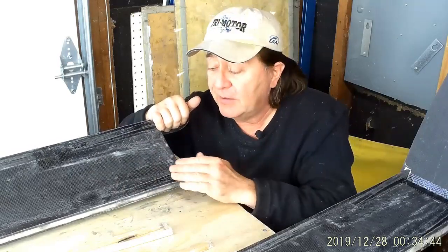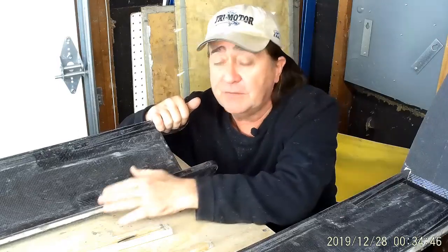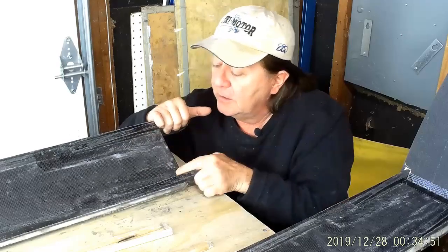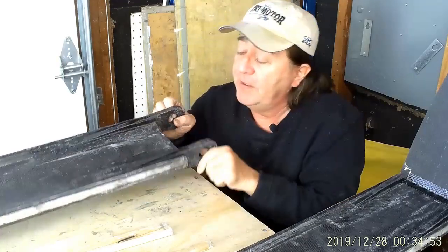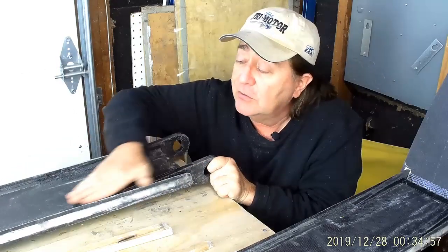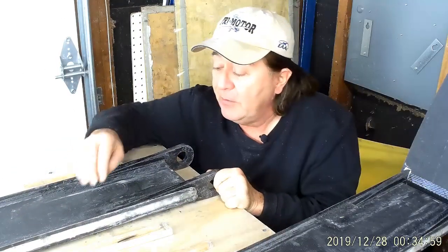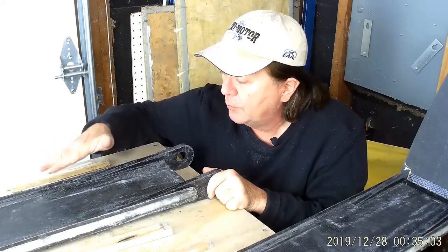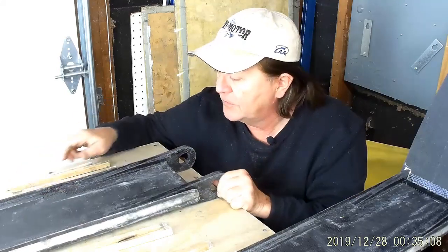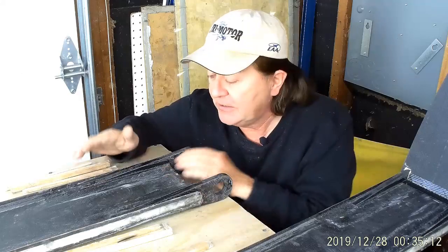And I've talked about the lifting forces involved at the inflection point where those straps go down the taper of the fitting. Maybe it's better if I hold it up this way. It goes down the taper of that fitting and then goes out flat along the shear web. And I've done an overwrap to prevent the load straps from pulling loose by straightening out with the loads that are on them. In the next fast forward segment, you're going to see how I actually did this work.